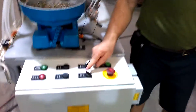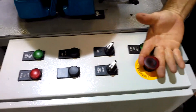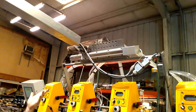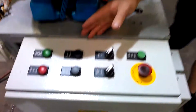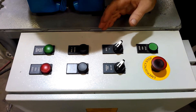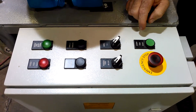I want to demonstrate something. If you accidentally leave it in the manual-on position and then repower it — right now the PLC is rebooting. If you look up here, it's not moving, and down here we don't have a green light. What's happening is the PLC is trying to process the information. We have told it to home itself, but we've also told it to go into manual mode. So don't do this.